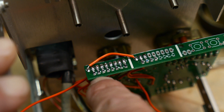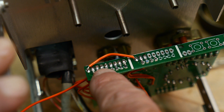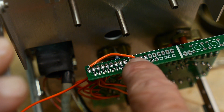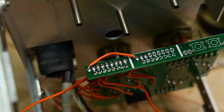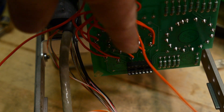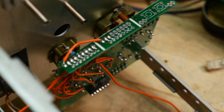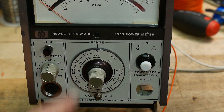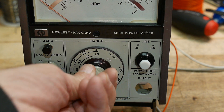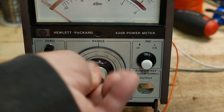So what I've done is I've put in 100k, 50k, 20k, 10k, and so on — 5, 4, going all the way down. I've wired it into one of the switches here. It's the big main switch. I've wired it up to that rotary switch, and that worked out good. So this is wired to this big switch here — the lowest current to the highest current. There are 10 steps.